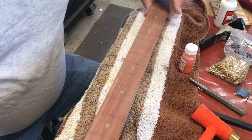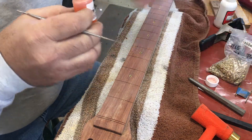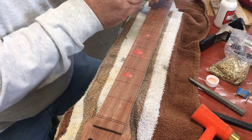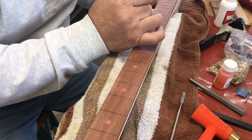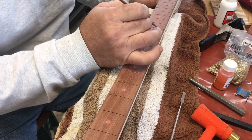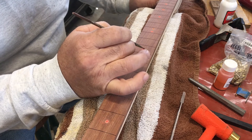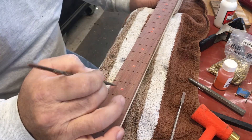I'm going to fill each of these little brass rivets with some red coral. I've got a little metal spatula here to help try to do this without getting it in my fret slots. I'm just using an artist brush to clean the dust out of the grain and clean off my excess. Trying not to go directly over where you want it to stay because it'll brush it right out. I do have a little bit around the outside of that rivet that I don't necessarily want there, but we'll see how it looks when it's done.